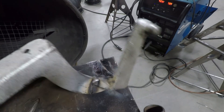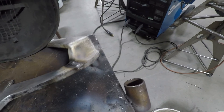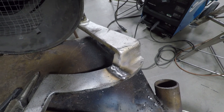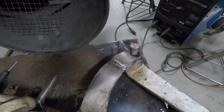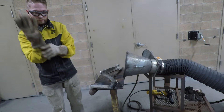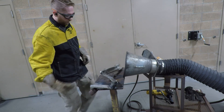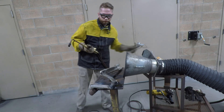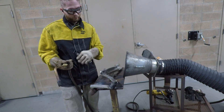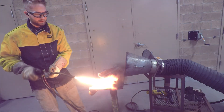It could be worse — it's pretty smooth. I'm going to take a sanding pad and just grind it down a smidge, try and get these corners. I know that one has to be zero interference so I've got to take that one down for sure. I'll smooth these out and see what's underneath. If I see some more imperfections or missed inclusions, I'll grind it down further and weld it back up again. I think we're about there — I'm going to keep this warm and keep going.